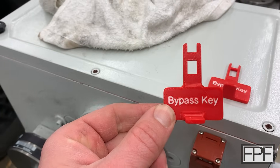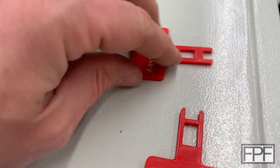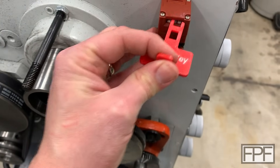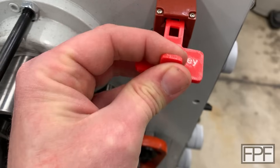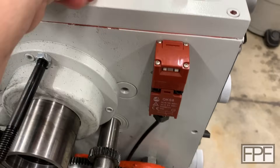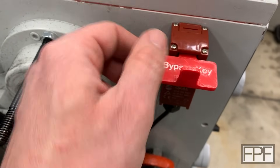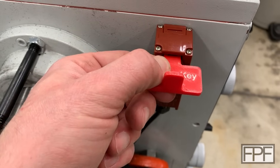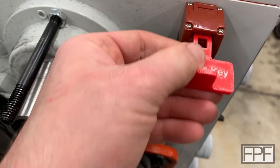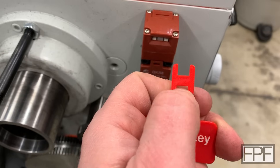Printed one with the changes — you can see we are thicker on the sides and the piece that engages that drum is way thicker. Let's try it... now it won't go in. I guess we have to be thinner with that section — it's really weird that the other one had so much play. I don't want to force it and break it off in there. It does start in so I think we're fine with the narrowed width on the inside, but I think we made that center part too thick. So I guess we're going for V3.